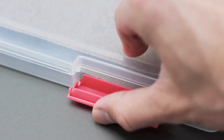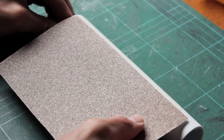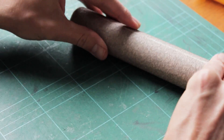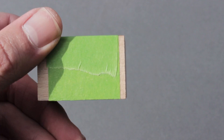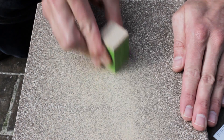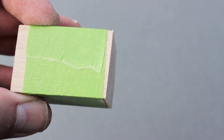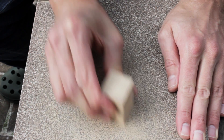If the area where you work suffers from damp, keep your sandpaper in a sealable box — damp sandpaper is useless. Sanding blocks and sanding tubes are easy to make with double-sided sticky tape, and you can make bespoke shaped ones for getting into difficult areas. I always have a sanding board, which is a piece of sandpaper taped to a flat piece of material like plywood. When sanding flat areas, sand evenly — our hands don't apply pressure evenly, so if we sand the whole time holding the piece one way we can often end up removing more material from one side.